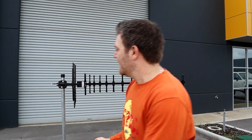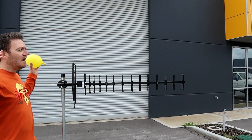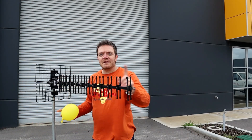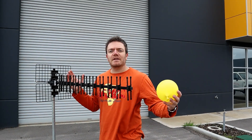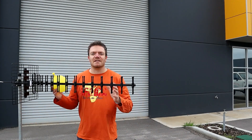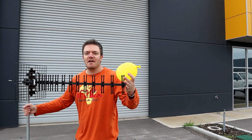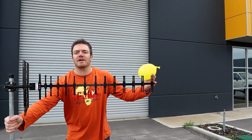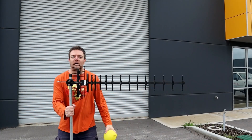Sometimes it's just long elements at the back, but the concept is that on this side there's not much happening — this is pointing away from anything useful, so this is the back. More elements will often make for higher and higher gain. As a basic rule of thumb, every 3 dB of extra gain means you need to go double the length — so if this one is quoted as 14 dBi, to get to 17 dBi it has to be double the length. It gets quite clunky, but this is a good antenna. Size-wise it's about one meter long.